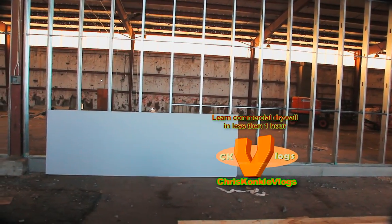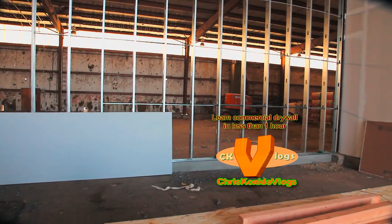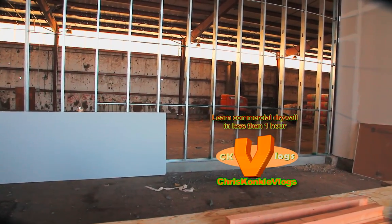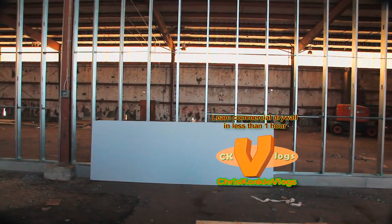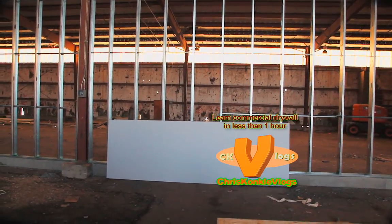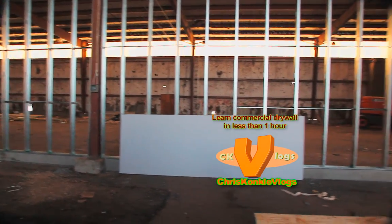That's a drywall tip. All right, so the first thing you have to do when drywalling is figure out your layout. So make sure that you have a full sheet. You start inside the wall somewhere with a full sheet and you cut into your ends. So make sure you can get that last sheet in. Make sure you check your layout.